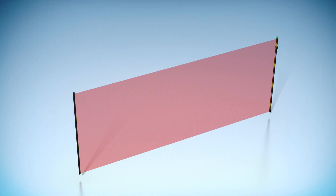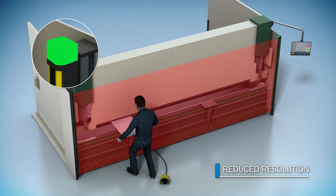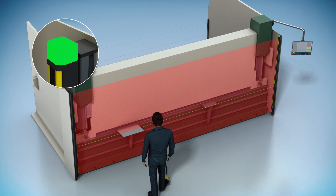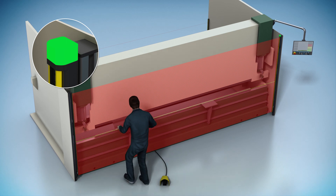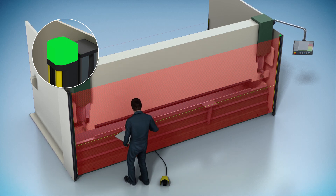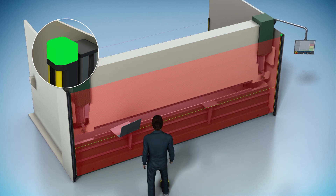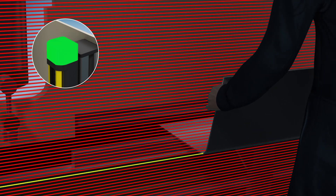The reduced resolution function always allows you to insert material into presses without triggering a machine shutdown. DTEK4 reduces the protective field by one or two variable beams. Even shavings and other small parts can fly through the protective field and don't impede the workflow. But if adjacent beams of a reduced beam are blocked, the machine safely shuts down.